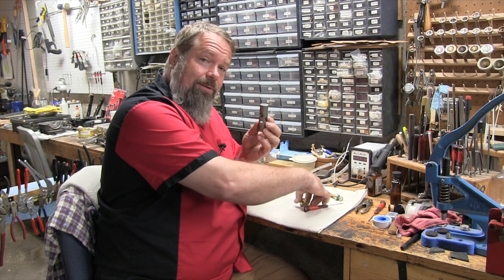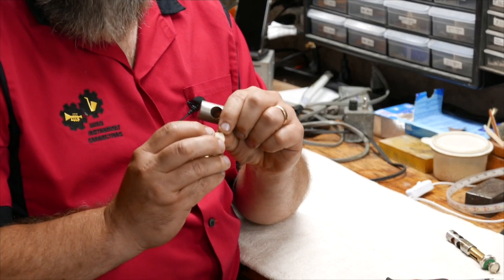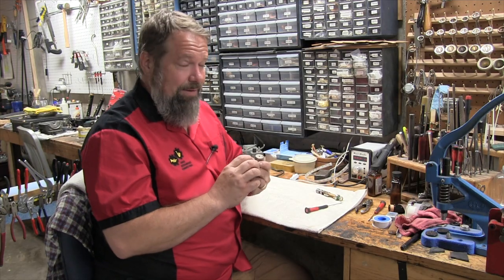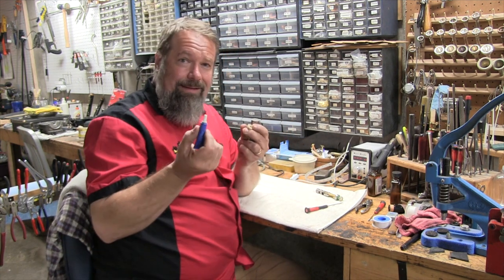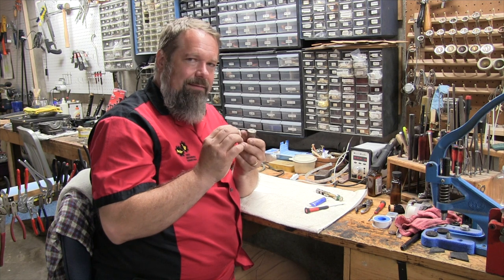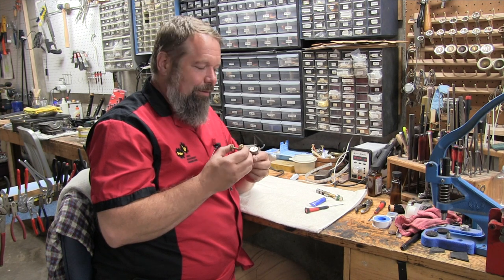All you have to do is reset that little bump in the valve guide back into its original hole and tighten the valve stem back down again. I would even advise maybe one little drop of thread locker on that stem so that it doesn't accidentally come loose again. Thread locker is great because you can get it unthreaded — just not without intending to.